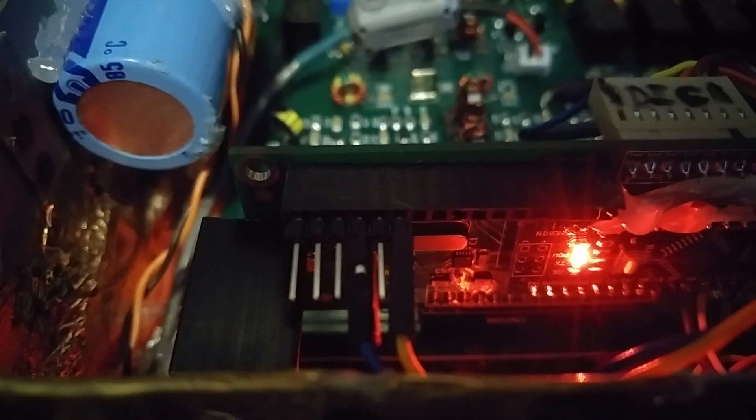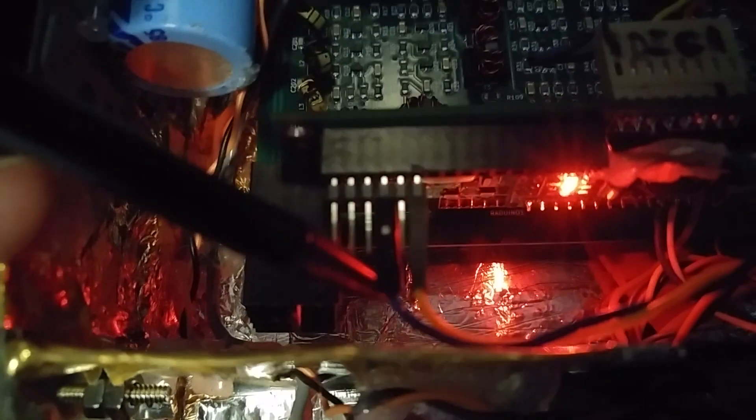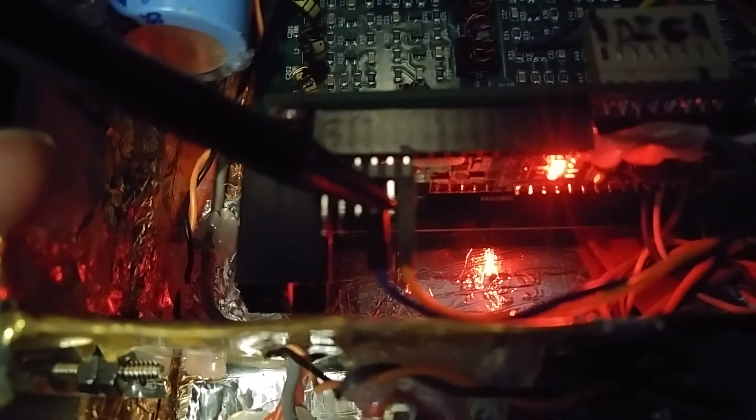Then plug your jumpers that come right from the display. These two wires are actually a yellow and a blue wire — they already have the little jumpers on them. One is blue and the other is yellow, and they're really just for your serial connection. So you basically put the jumper in, plug those in, and provide 5 volts to the red and the black wire. And that's it.